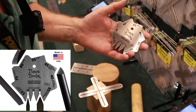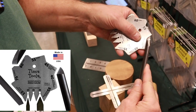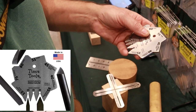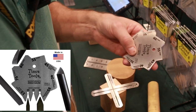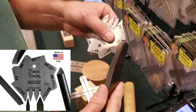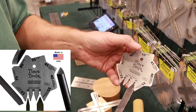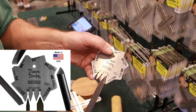Off the Simpsons, if you look at the shape. The whole idea is I didn't want to stick my tool into those brass gauges — you simply lay it on there, and if there's no gap, you've got the right angle. So if I was trying to do a 60 degree and I know I'm short, I have to adjust where I'm grinding — grind more of the toe off than the heel. This covers spindle roughing, bowl, and when I got into negative rake scraping I do a 75 and that little relief is a 15. You can also put your skew and parting tool in there — if a skew fits perfectly, you're at a 45.